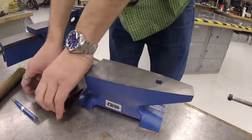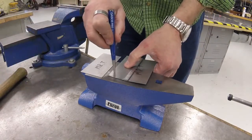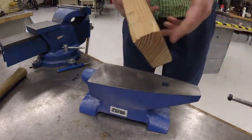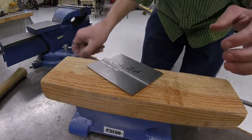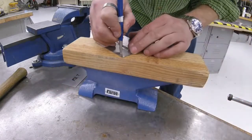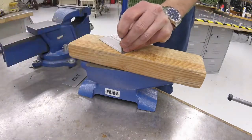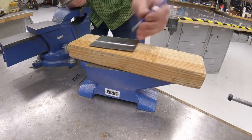Here on the anvil, I'm going to punch some holes. But if you remember from the hand tools section, we can't just set the metal on here and start pounding — it's not going to work. We need something soft underneath. In the cabinets down here we have pieces of wood — nice and soft. Set that on there, place the first piece on top, take the pin punch and set it on the X mark. Take your time getting it lined up so it looks right on the X, then start hammering. It probably won't go through on the first try.